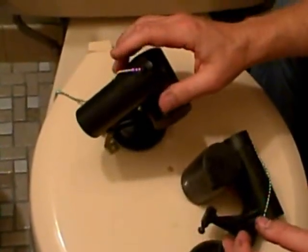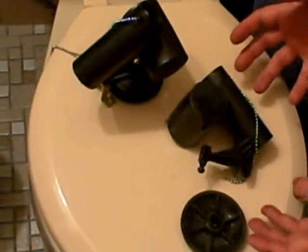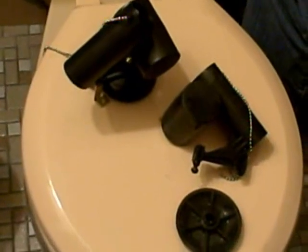This will not fit into this toilet. So it's very important if you're looking for a flush valve for an American Standard, that you look at the existing pieces, and if possible, bring them in with you when you exchange it at the hardware store.